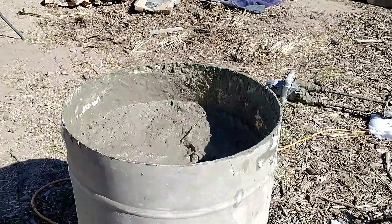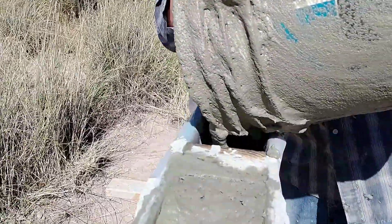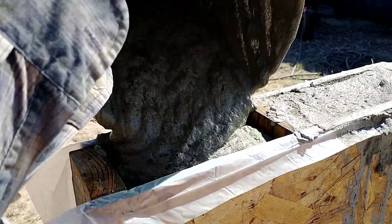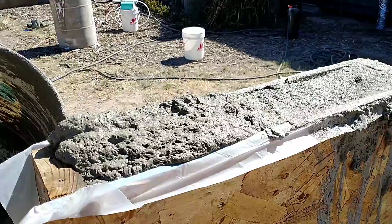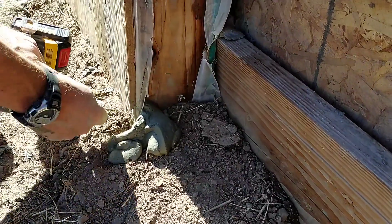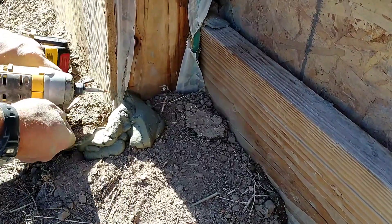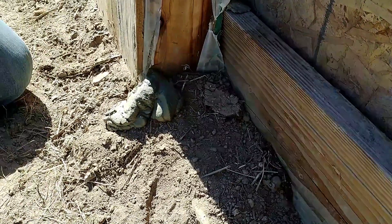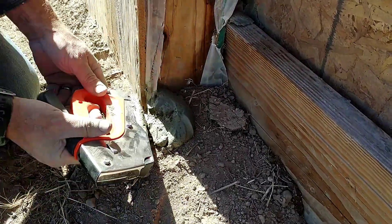Here I am pouring it into the mold — we had high hopes this would work out well. Unfortunately it didn't take long before we started to see leakage out the bottom. This was surprising because I had just reinforced it after finding the leak on the other side, yet it was still leaking. I was shocked at how difficult it is to seal when you're pouring at height — 45 inches, close to four feet. That column of aircrete creates significant pressure at the bottom, so we had to take more measures to seal it and ended up working really hard to keep the aircrete in.